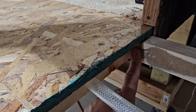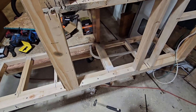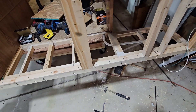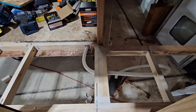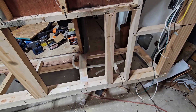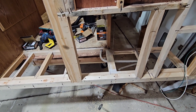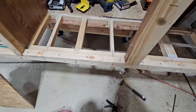That way it makes this joint stronger and it'll be beneficial overall. The plywood floor will have something to go to evenly. I got the two by two in place, screwed end to end and side to side with liquid nail, and drilled the hole through it. It looks way better now — more of a spine, more support for the cargo box slash wing side. Now I can put the boards down and everything will overlap each other with a nice mating surface. I quickly screwed down the door spacer as well.